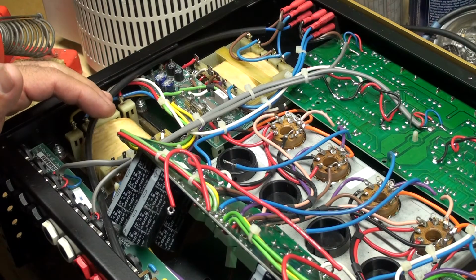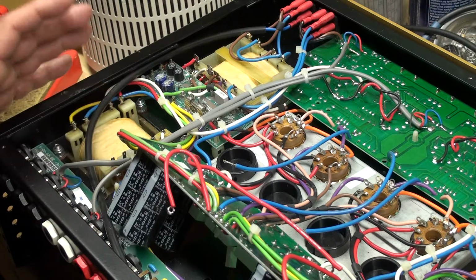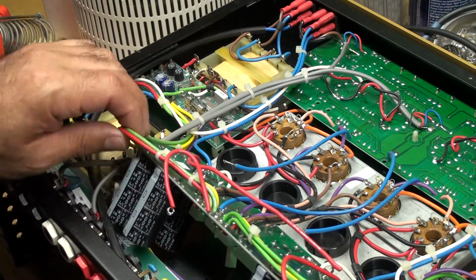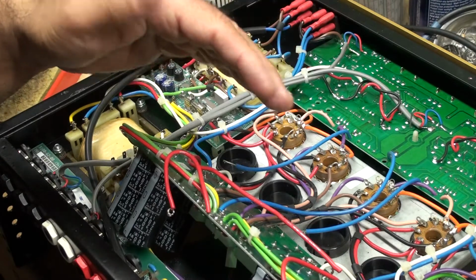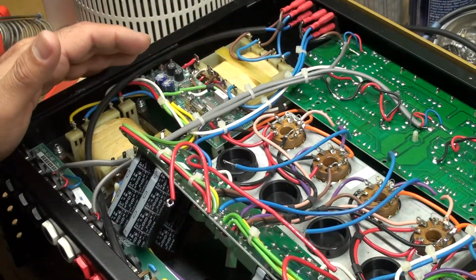So as of right now, I'm gonna go off camera, I'm gonna unsolder this stuff, the capacitors, the filter capacitors, and the screen resistors. Then I'm gonna mount everything back. So I kind of went over which wires got unsoldered, so you guys saw that already.